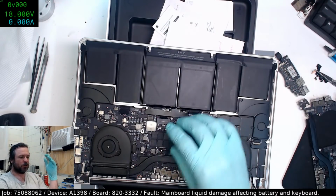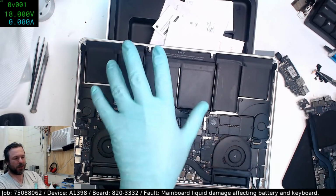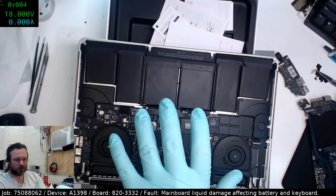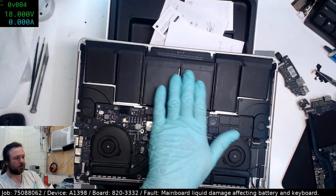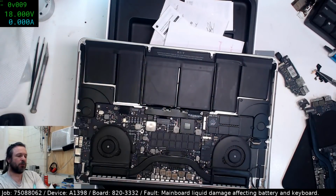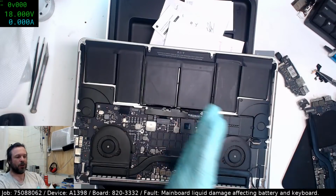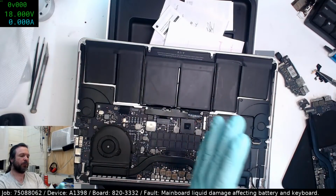But once you get above a certain threshold, which depends on the manufacturer, but usually it's around 2.75, 2.9 volts, you can then get up to the normal rate, which is usually whatever the capacity of the battery is in terms of amps. So if you have a 10 amp hour battery, you can typically safely charge it at a 10 amp rate. The new batteries that are out, you can also do 20 amps, some even 30 amps. We refer to this as the C rating, so that you don't have to keep referring to the particular milliamp hour versus milliamp charge rate.